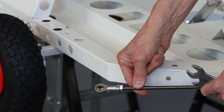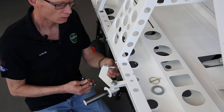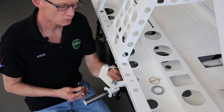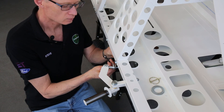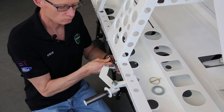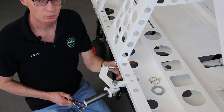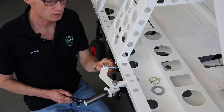That means your steering is not going to fall apart when you're racing. There are actually four lock nuts to do — one on each end of each of the two steering arms. Turn it by hand up to the rod end, place your spanner on the flats of the rod end, and then with another open-ended spanner on the nut, turn and lock it. The important thing is to remember to do all four of those — go to the other end of this arm at the centre point where you'll find another lock nut, then the matching ones on the other arm.